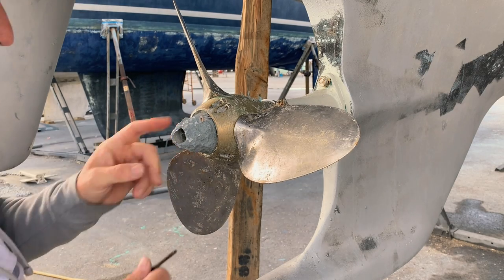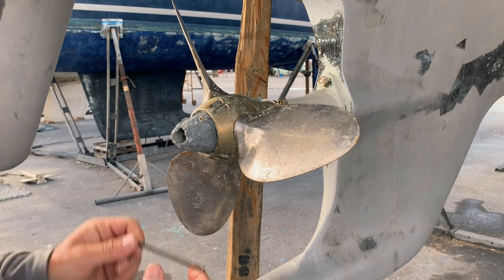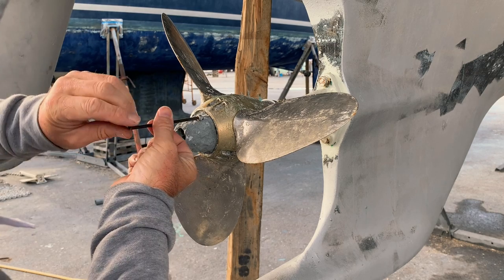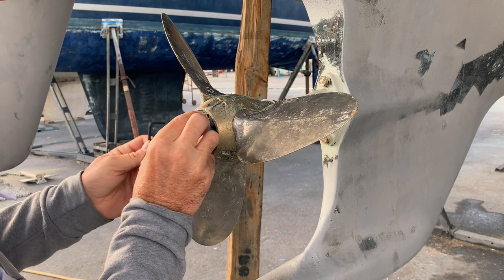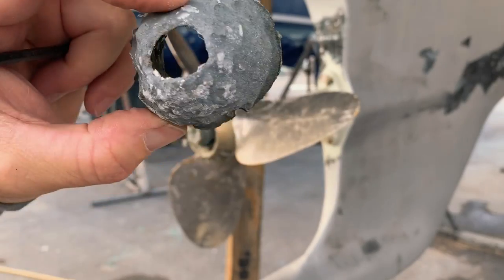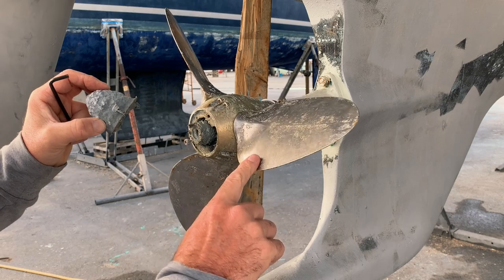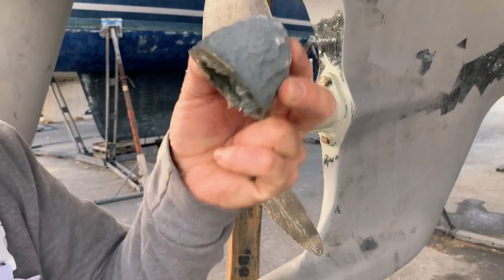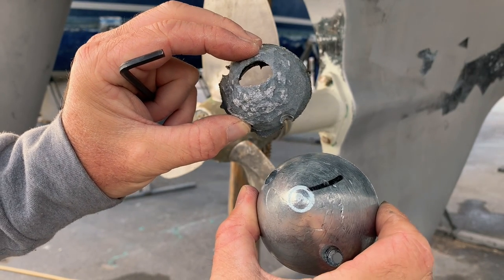As you can see, this is the remains of one season's use of our anode. It is always much worse when we are in marinas — stray currents in marinas absolutely destroy these things. Other boats may have stray earths even if ours is completely earthed. For those who don't know, the anode is sacrificial — zinc is more attractive to electricity than the brass of this prop, so rather than stray currents eating away at the prop, it sacrifices the anode. One anode, one season — incredible.